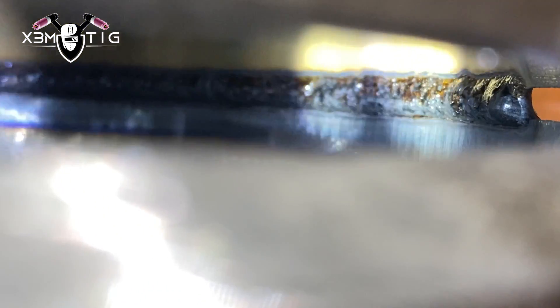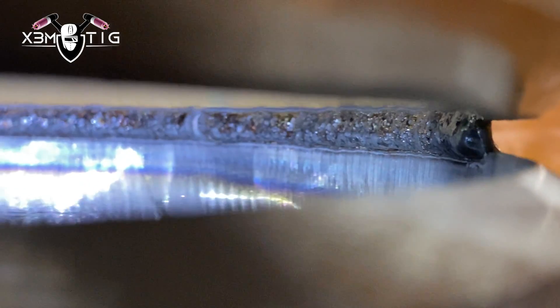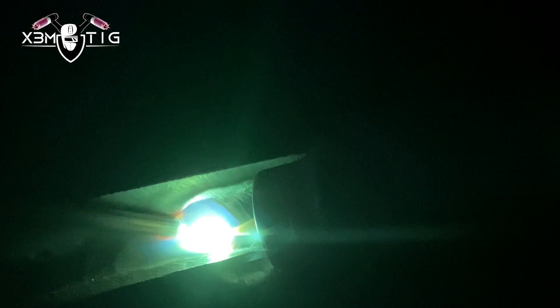Just try to keep it constant and connected to that puddle going slow, preventing that steam from turning to liquid. The steam on this side is almost gone for a moment — it just comes and goes as the valve passes. This is a good healthy root with lots of meat, so I can run 160 amps for the hot pass. This is a closure weld procedure, so MT on the root has to be done. I like to run a grinder all the way around just to surface it, then run a wire wheel.